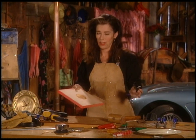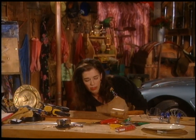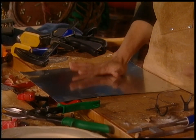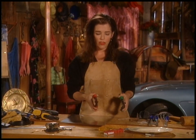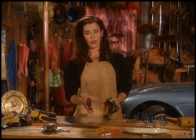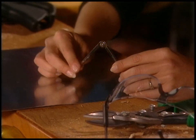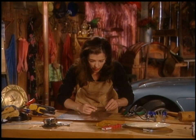The face is more interesting — I wanted to try a steel face. This piece of galvanized sheet metal is what they use to make those big ducts in heating and air conditioning systems, so it's available pretty much everywhere. When cutting this stuff — I usually work with copper, which is really soft — working with sheet metal is a little unforgiving. There are two kinds of tin snips: these want to cut to the right, these to the left. I'm left-handed, so I have to use these. Now I'm going to scribe a circle on the metal, working close to a corner so the waste margin is thinner.